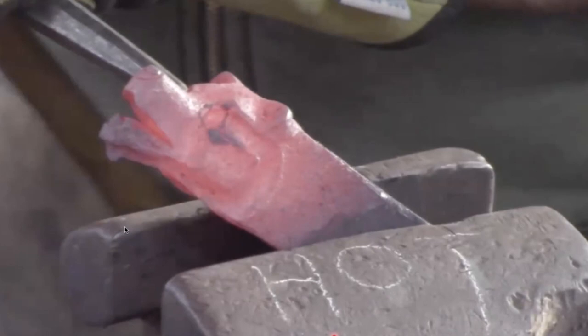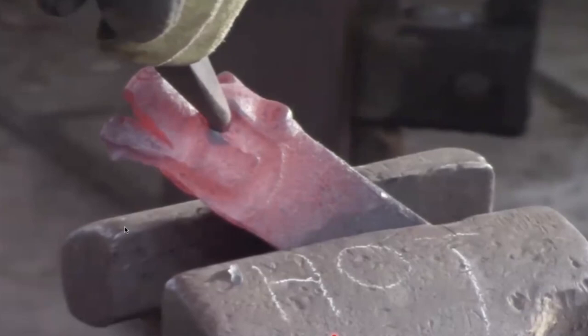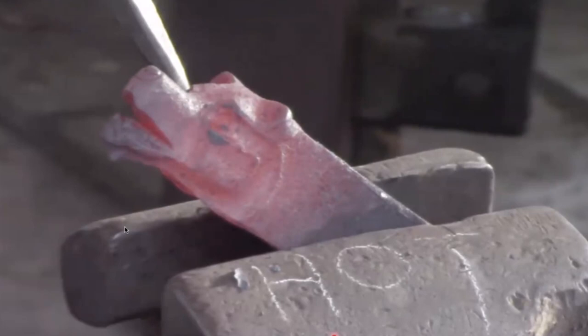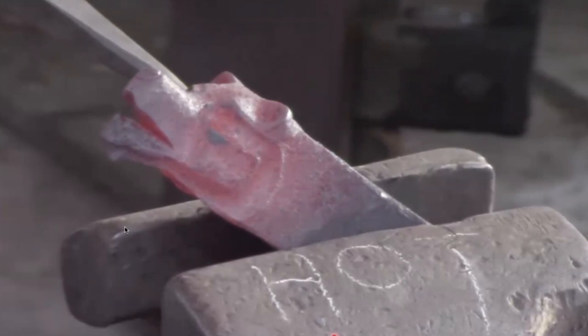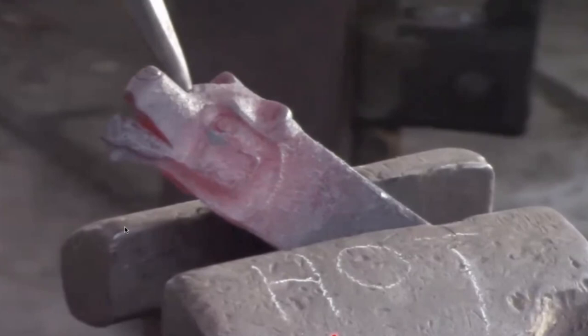It's another view of the same moves. So I've just created, just cleaned it up. Now I'm going to come in with my eye. Notice I swing a nice arc of this eye. I'm just trying to gather the material, not drive it in too deep. I'm going to get rid of the cheeks. Sorry about this. The camera and I are both fighting for the same view.